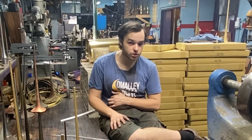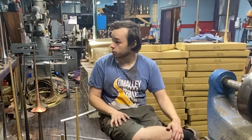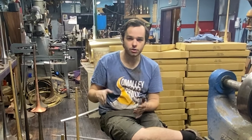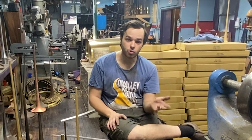The mandrels I make today are made from tool steel — typically D2 tool steel because it's the most wear-resistant, even in the annealed state. The mandrels back then, it's hard to say what they were because tool steel wasn't a standardized thing yet — even when Bach was making mandrels. The closest relationship I've found is to a 4140 or 4340 alloy steel, and they were cast. I have wood molds for them. They were cast blanks of alloy steel, a high-carbon steel, and then machined out of those castings — which is amazing. A foundry taking time to cast bell mandrels for a musical instrument company.